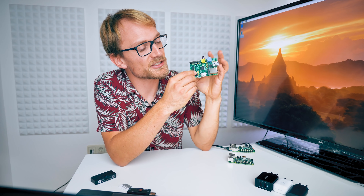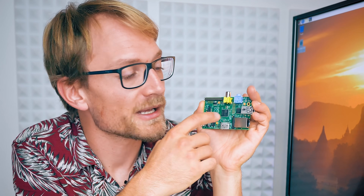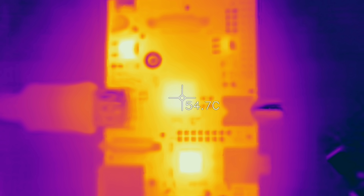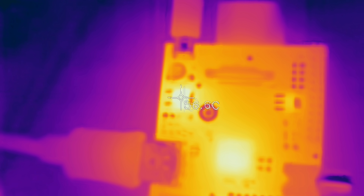Talking about temperatures — the Raspberry Pi 1 is a really low-power board with three components that generate heat: the input linear regulator, which burns off the extra voltage from 5V down to 3.3V for the CPU; the CPU itself; and the Ethernet chip. No matter what you do with them, they all hover around 50 degrees, or 55 under a stress test. This thing doesn't really heat up at all — 50 degrees with no heatsink is fine, and it definitely does not need one.